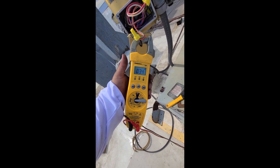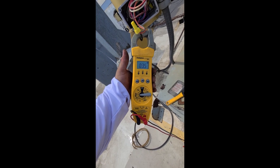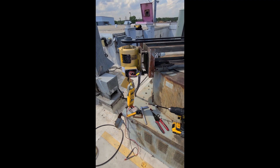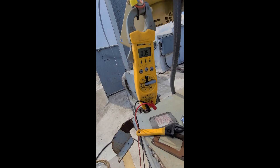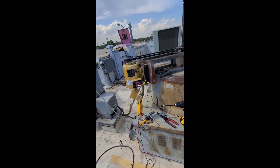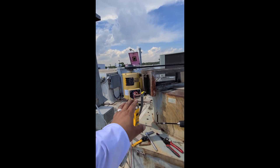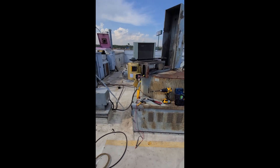As long as those two legs are under 4.4 I'm happy. I'd like it to be a little bit lower, but that's fine. Let me see if I can possibly loosen it a pinch. As of right now we're good — 3.4 and 3.4. This motor is good to go. I raised the pulley as high as I can get it and you can see the belt is pretty decent, but the old pulley still needs to be replaced — we'll address that later. There you go.